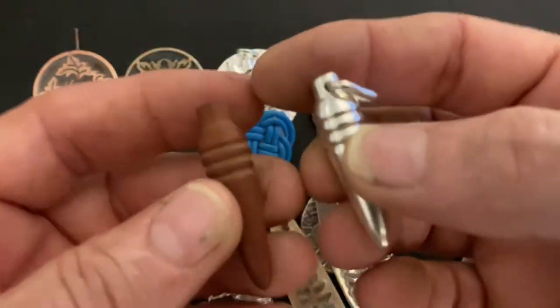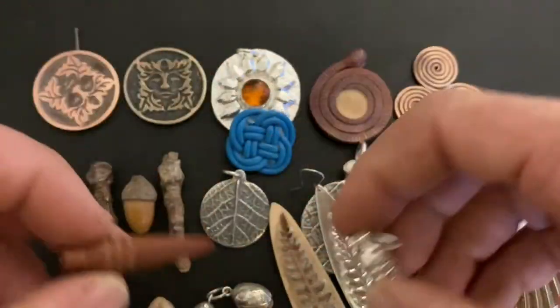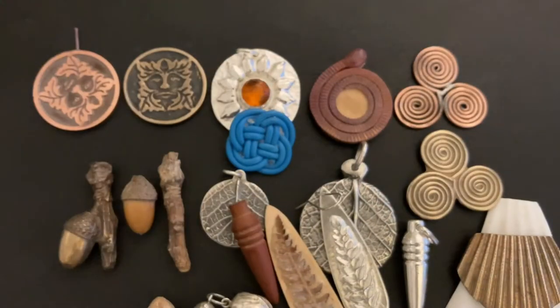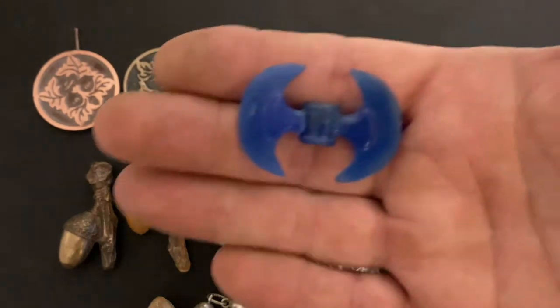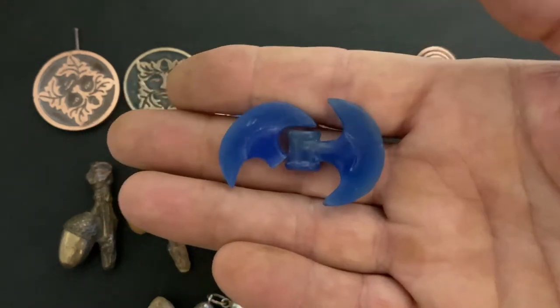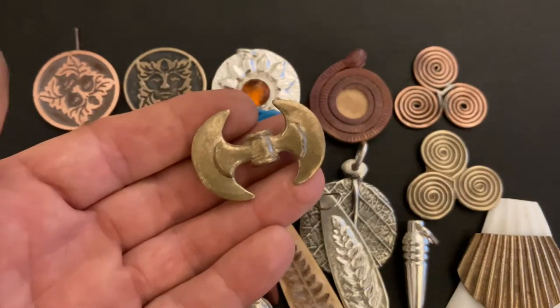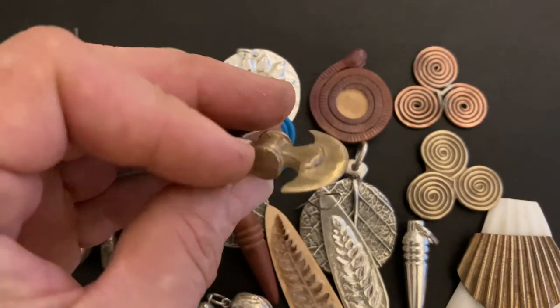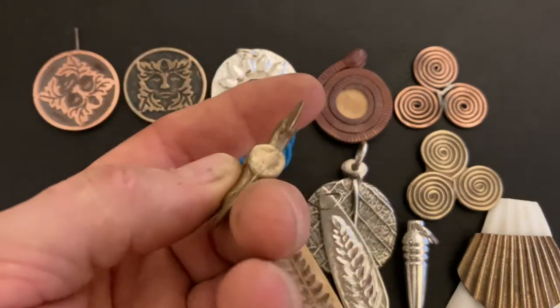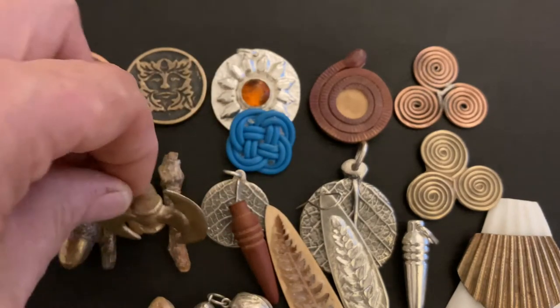Electrical wire is great for tying firm knots. Using wood is a very traditional material for making patterns, being strong and hard but easy to carve and shape. Carving wax is great for producing intricate patterns, although somewhat weak when making delicate pieces. I've managed to cast a few times from this pattern before I broke it. It's always worth keeping a first casting as a new pattern, so now it's much easier to cast from this strong new bronze copy.